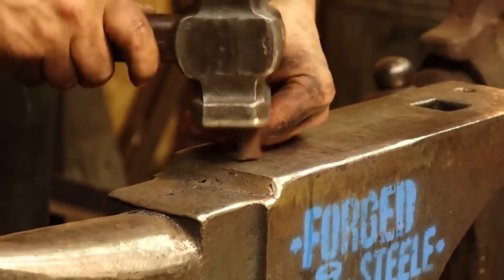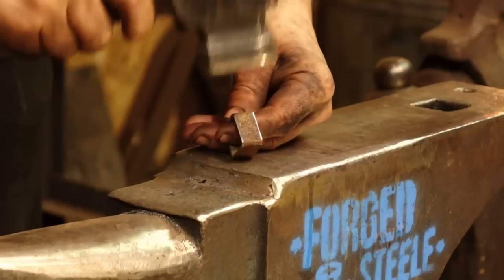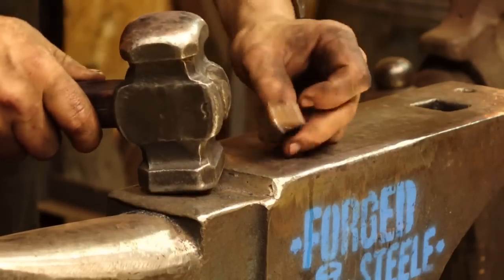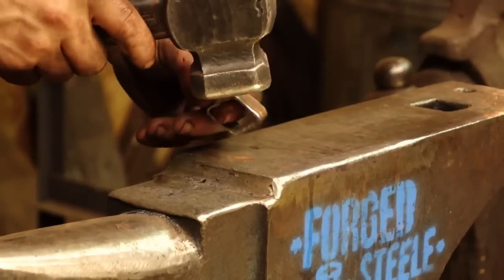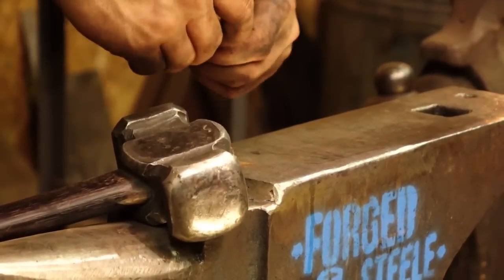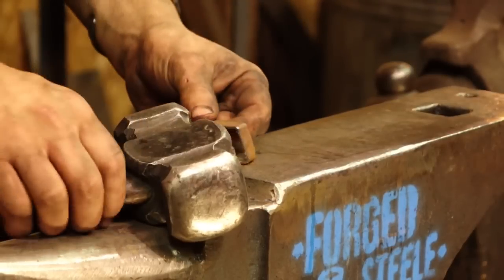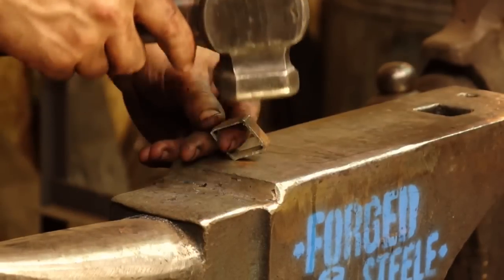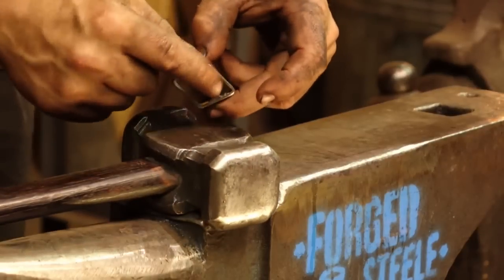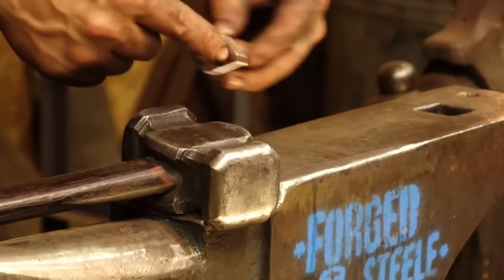I really was thrilled when I saw this tong clip idea, the tong clip design. I have no clue where it originates. A lot of these things certainly don't originate where one has found them. But I first saw this on Ed Brazil's tong rack. It's simply a piece of square tubing, flattened, and then you get two sizes of tong clip.